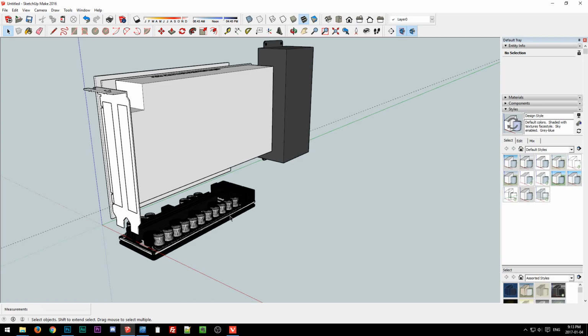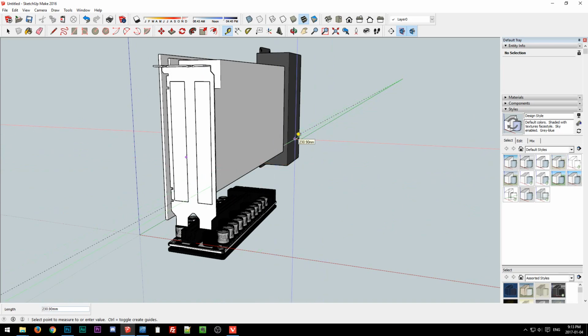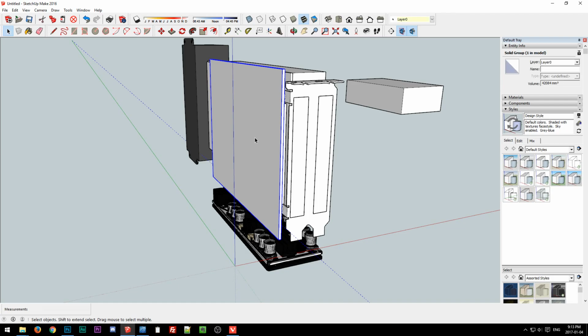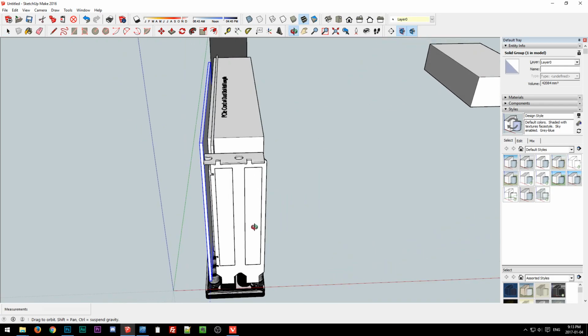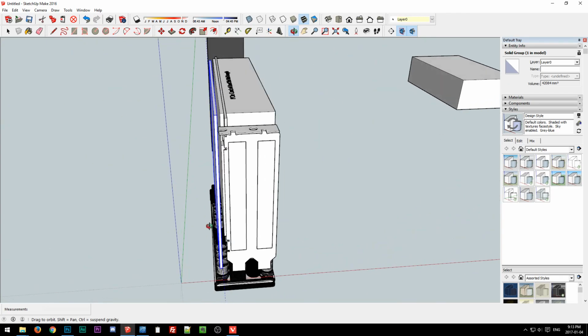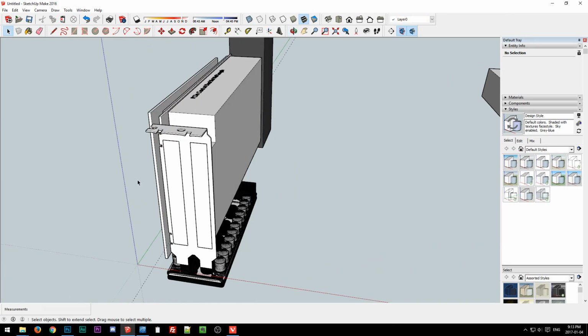So yeah, I don't know what we're gonna do with that space. Oh yeah, cooling fan. Yeah, that's true. I guess you'd be limited to like a 40 mil fan, because there's really not any good justification to make this wide enough for a 60 mil. I didn't take into account earlier that this circuit board is going to need standoffs to space it off from the sheet metal so it doesn't short out something on the back side. But even then, I don't know what it would require. I could probably just measure what it is in the current housing, but with ATX based motherboards, it's 6.35, which is a 1/4 inch.